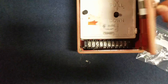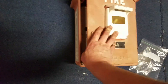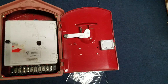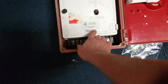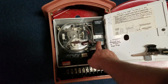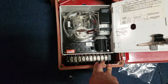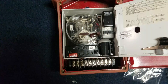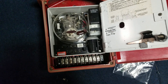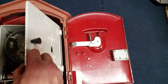The outside of the box — I don't want to say it's in rough condition, but it's not in the greatest condition either. The inside of the box I think is in pretty good condition; the paint is still nice and red. In fact, there are still stickers on it. If we open this up, there is the local energy trip. This can actually be wired into a fire alarm control panel so that when the panel activates, this little arm will push this lever down and set the box off, just as if someone had pulled the lever on the front.